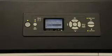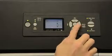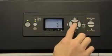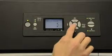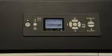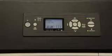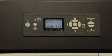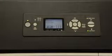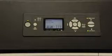The next function is regular cleaning. This will dictate the frequency that the GS6000 will auto-clean itself. It is recommended that if your GS6000 is not in full production use, the regular cleaning cycle should be set to a short duration, where if the GS6000 is in a high production environment, it is possible to turn the regular cleaning cycle to a higher interval so the GS6000 does not clean as much.